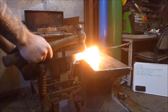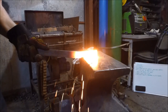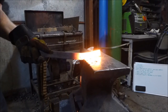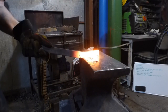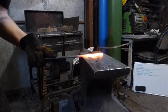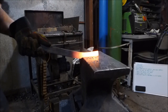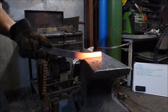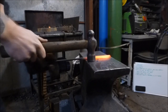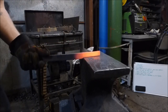We've got our set down set in. Give that a couple more backs. Now I'm going to tip her forwards and bring this front down and work back to where the set down started. Just keep doing that, working back. Now I'm going to turn it through the side, just bring it back to a profile that matches the existing stock. This is bent up on me a little bit, I'm just going to turn it over and bring that down. Then I'm just going to take the corners off.